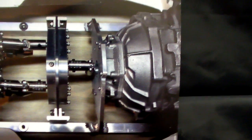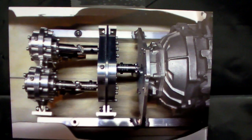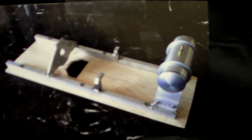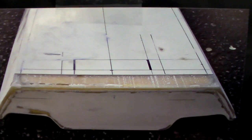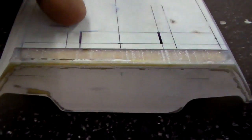I had to build the front motor mounts — there's thick poster board I used to cut out my patterns for the mounts. Here's a shot after I had tack-welded in the plate for the bell housing and center support bearing. Then repositioning and figuring out where the transfer case and V-drive were going to be located. There's the stringer layout for the boat — the engine mounts to that — and that was all put back into the boat. Then I set up my router table and routered a one-eighth inch deep groove all the way across the back of the boat, about three-quarters of an inch in.